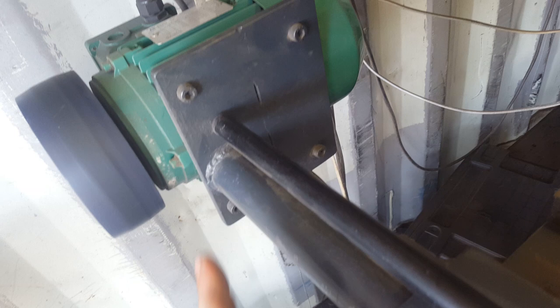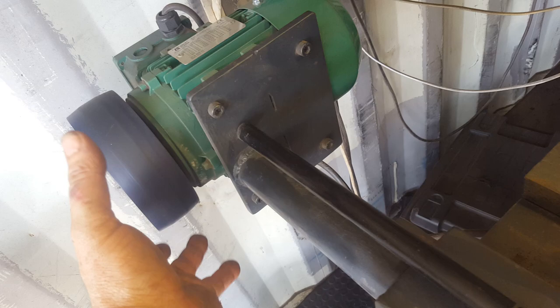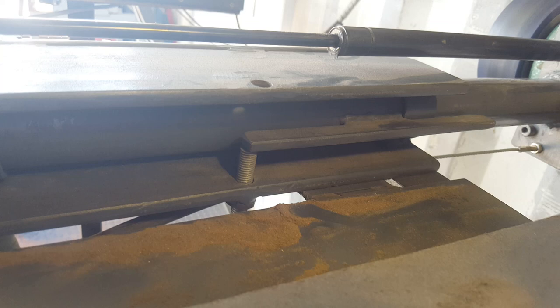Split the base plate in half, center the bottom section or bottom quarter. That'll give you a top-heavy, back-heavy positioning, so the motor constantly wants to tilt this way. And by adding a stop plate at the bottom there, and a screw — I turn the screw in, it lifts this up and the motor itself tilts that way. Fairly simple.